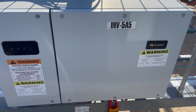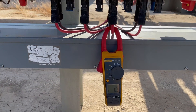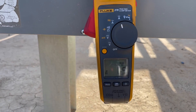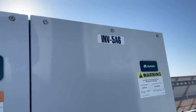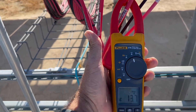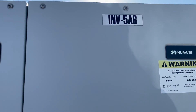Sentinella, September 3rd, troubleshooting two inverters. Inverter 5A5 has one string missing on channel 3 because it's only got half the power — it should be 13 amps but it's at 6.9. And inverter 5A6, the one next to it, channel 2 is missing one string because it's only half power.